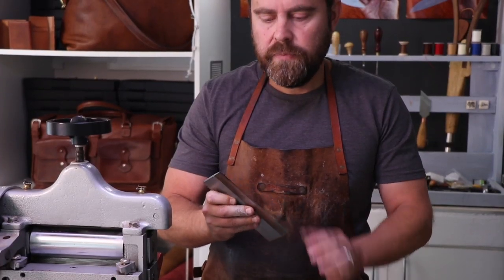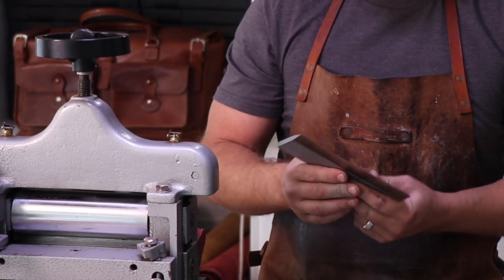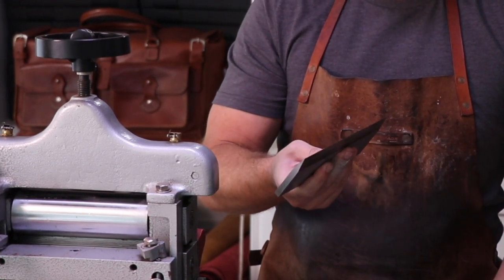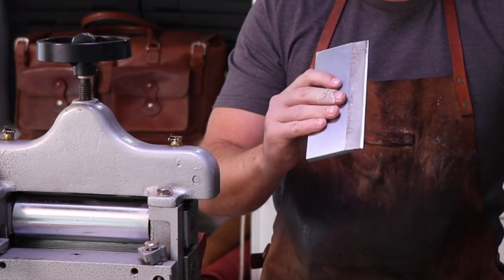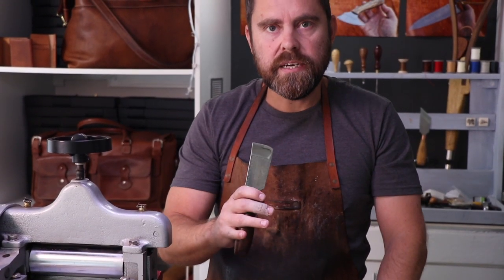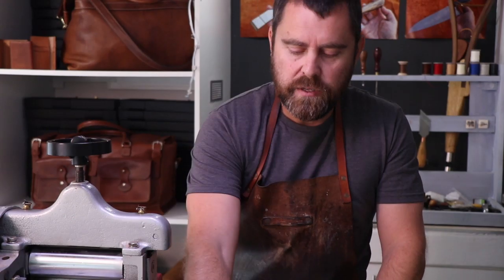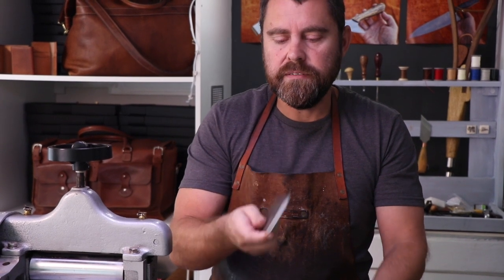Be careful when you're handling your blades, especially if they're sharp. The best upgrade I've made to this machine is changing out the blade. When I got the machine, the blade came with quite a flat grind — I'm going to explain what that means in a moment. What I've done is create a blade that has a hollow grind on both sides. If you have one of my scarving knives that I make, that's a hollow grind — so the blade has been done the same way as the scarving knife.